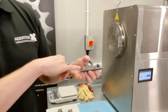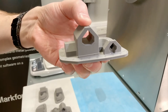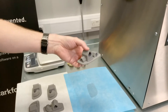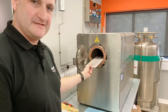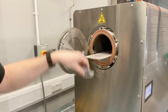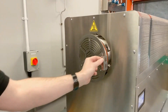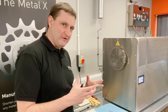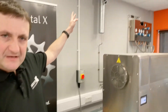Zooming back in on this part, you'll be able to see the white support structure — this is the ceramic release layer we mentioned when looking at the printer. When the part is sintered, the raft is released from the part, leaving it by itself. Once it's debound, we move to the furnace. The furnace itself is cylindrical. We have a ceramic setter plate which the parts are placed on and slid into the furnace. A stopper plate is inserted inside, the door is locked using Allen keys, and we sinter from the front. Minimum PPE is required — just gloves for handling the hot plate.